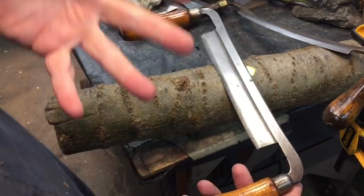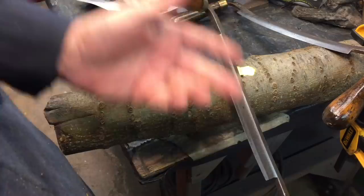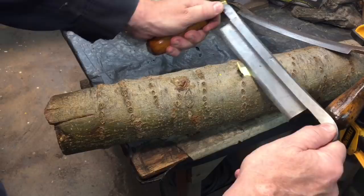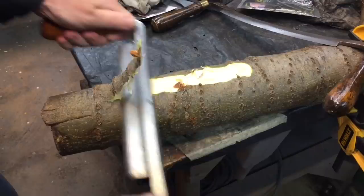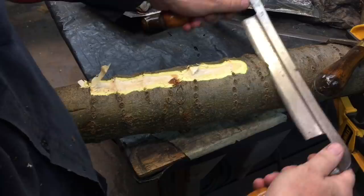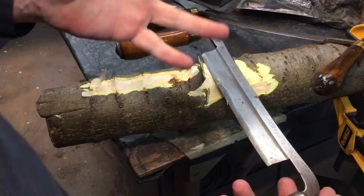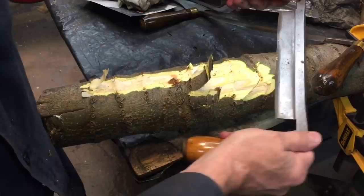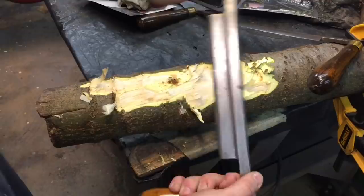That's why you have to pick one of these up at a flea market. It doesn't have to be razor sharp — this isn't razor sharp at all. I clamped it down here and you're going to just take a stance and pull it back. What you're doing is shaving the bark off this branch. A lot of times I would make flag poles — when we got up to camp, I'd drop down a tree and then shave all the bark off the flag pole. You can see how easy it is to do. When you're using a draw knife, it's so intuitive. You could draw it straight back, but if you turn it a little and pull one arm a bit closer, it gives an easier cut to the wood.